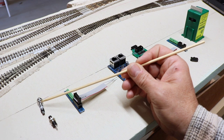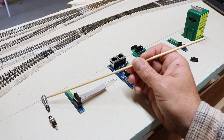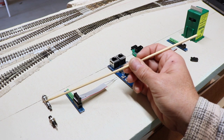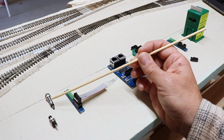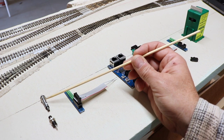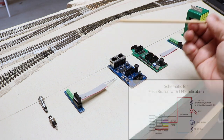And I'll say this about this particular LED. It's a 12 volt LED, and I have tested it. It works fine with 5 volts. There is a built-in resistor in there. I have no idea how many ohms it is. I tried to do some research online, couldn't find anything. And another interesting thing about this is it doesn't tell you which side has the resistor on it. So it's kind of guesswork, and I'm going to have to go in and apply 5 volts to each one of these and then mark which side is the positive, because if you hook it up backwards, you're not going to get a light. So that's going to be my next project, making sure I know which side of this is the positive, which should be accepting the positive line and which isn't.